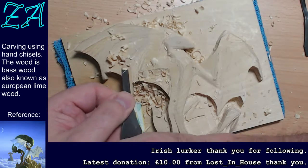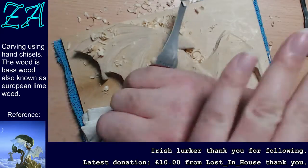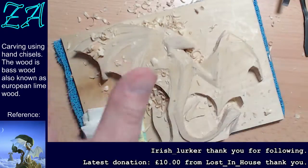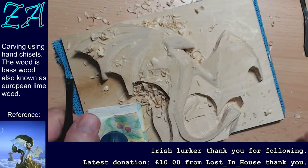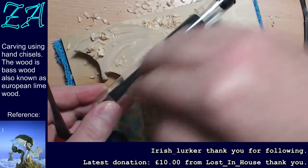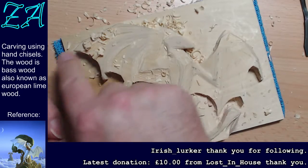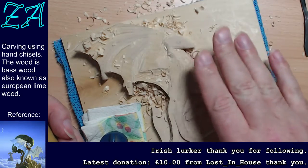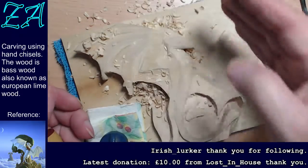Because what you've got with a piece of wood, generally speaking, if you take a trunk and slice it vertically and horizontally, across the length of it, they don't often go crosswise. If that was your tree, they don't often cut downwards like that. They cut across and across that way. So what you get is that the grain generally runs all the way along a piece. You don't often get a circle in the middle like that. If they're doing what they call blanks, which is just a block of wood for bowl carving, then yes, that's what they do. They go vertically through the tree.